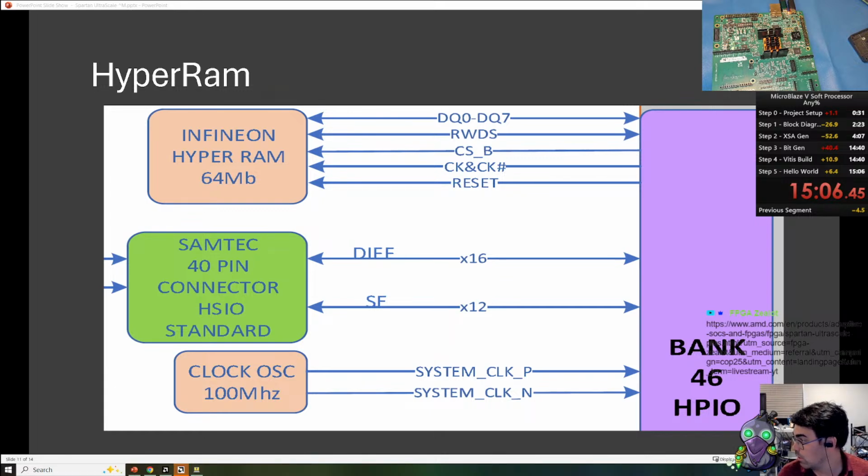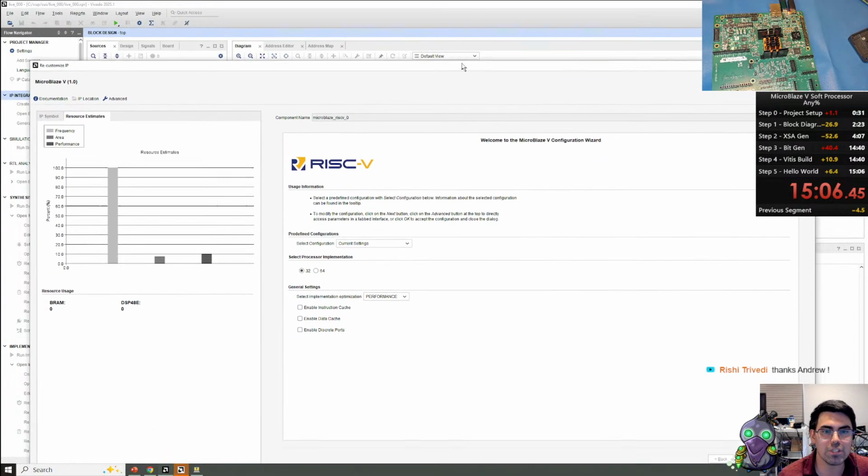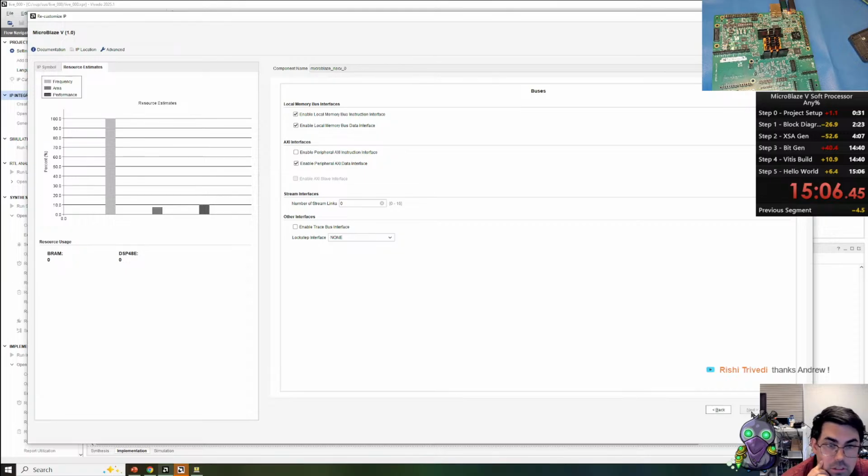Okay, we are closing up. We can take a moment and look for the MicroBlaze lockstep. Let me look. It might not be implemented for the RISC-V yet. So where is this? This is a MicroBlaze architect question. Okay, so let's go look at that real quick in Vivado. I think we open up this, make this a little bit smaller. Okay, cool. I think the last page, breakpoints, interface, lockstep right here. Okay, we do have lockstep. We can do lockstep master, slave, and hidden slave.